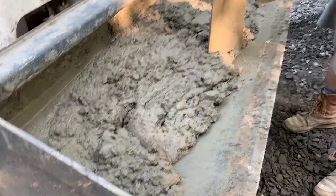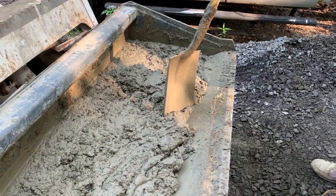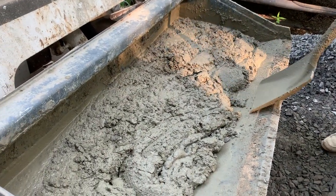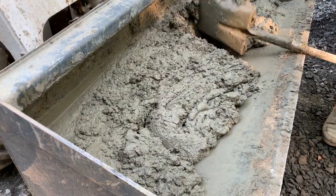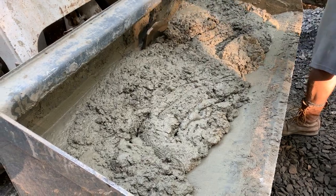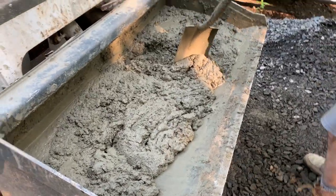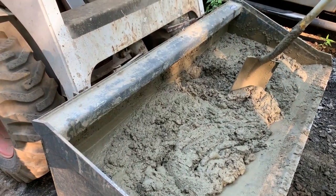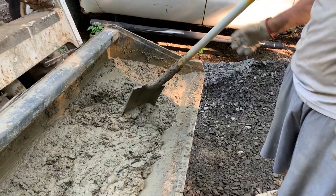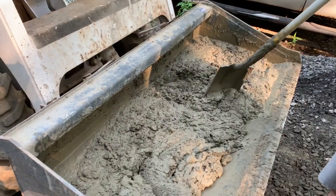But one thing you want to consider whenever you hear about mixing concrete, you hear this 1, 2, 3. One part Portland, 2 parts sand, 3 parts aggregate. Well, that works fine. But when you go to do your calculation for how much concrete you need, you have to understand that you're probably adding also one part of water. That's an important thing to understand, because you're taking a whole pail of water or more and mixing it in with those other pails. So that actually takes up volume.